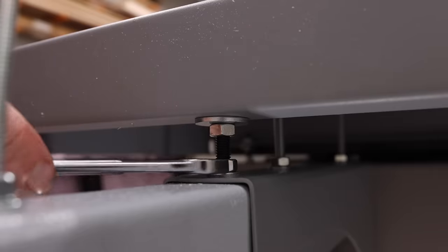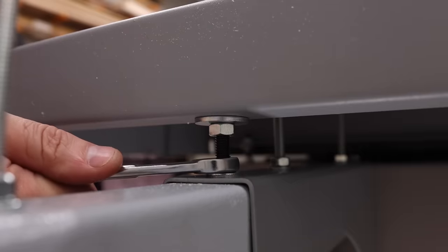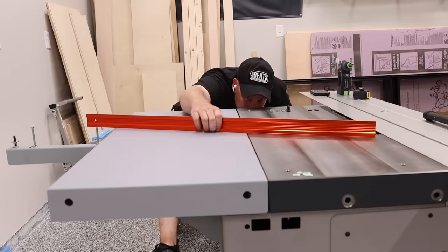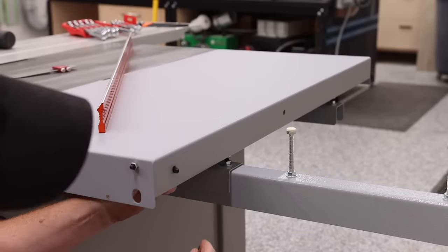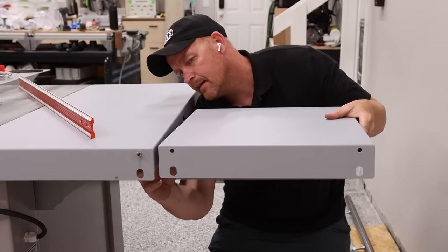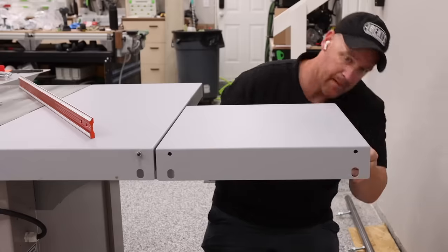This is where I started the leveling of the table — that is what the black bolts are for. I worked my way through each of the bolts while periodically checking to make sure everything was flat and coplanar. I used a standard straightedge in various locations, and as I was happy with the results, I tightened the bolts down to lock everything in place. Next, I added the second support table and followed the exact same steps. However, there is one difference: the smaller table doesn't only attach to the support rails, but it also attaches to the other support table, which helps keep everything very rigid.